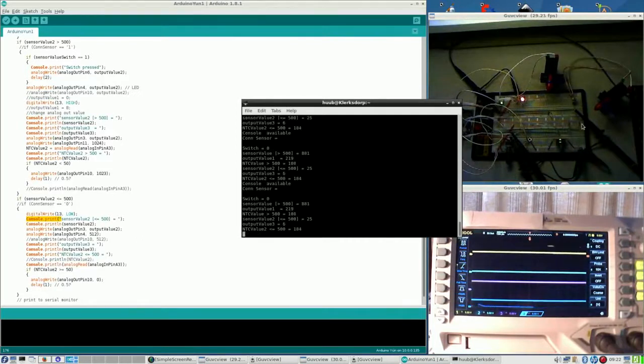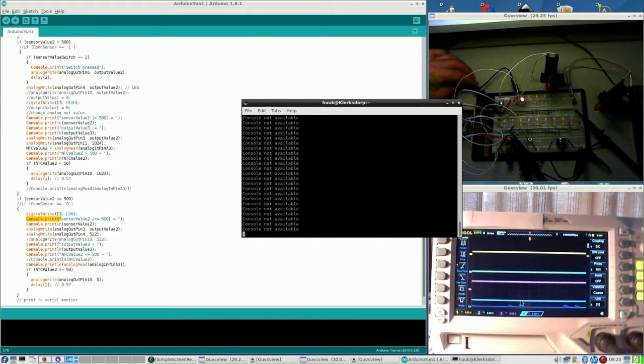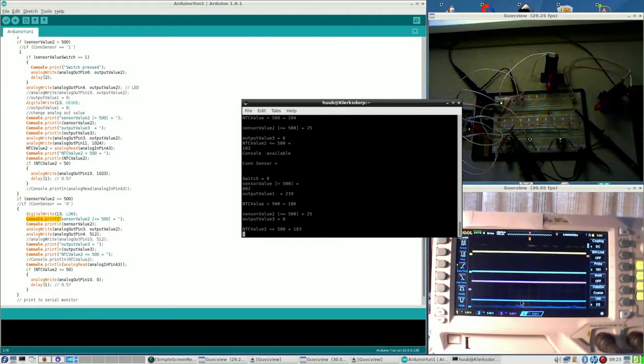That said, I have a little problem with this, because this should be the same kind of output as the yellow line. But as you can see, that is not happening. So the question is, why isn't it happening? It is set to 5 volts as the rest is, and it is connected to the circuit. But this is not what I consider to be pulse width modulation.